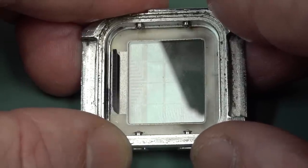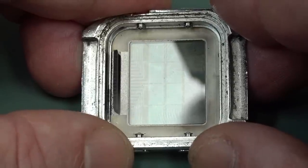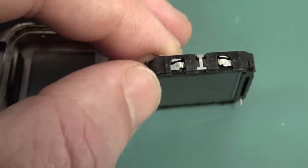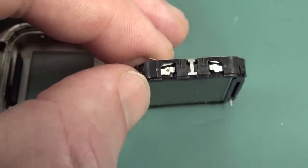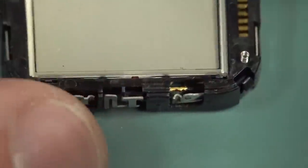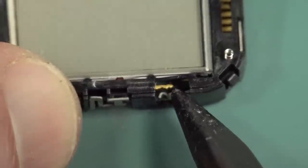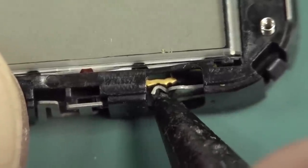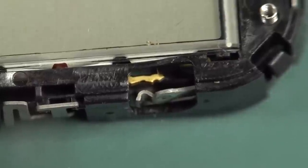Touch technology — you take it for granted now, but it's embedded in microcontrollers these days, or you can get dedicated Atmel touch chips and other brand touch chips. But back in the day, this would have been state-of-the-art stuff, really. It's gonna be a single chip solution. You can see the contacts on the side there, which then connect between the top metal plate and the side when you push in the button — that's how the buttons work. You can see how the contacts work right here: when you push in the side, it contacts the gold castellated edge — the gold-plated edge on the PCB down in there. The metal backing is like ground or whatnot, and that makes contact with the gold-plated edge of the PCB.